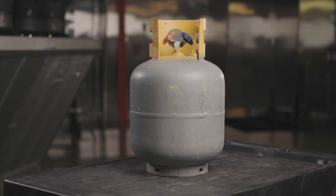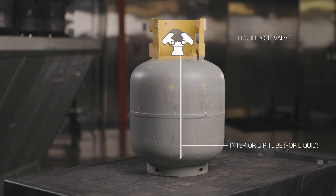If using a recovery cylinder with clean recovered refrigerant to recharge the unit, be sure to connect the common yellow service hose to the valve marked 'liquid' on the tank. There's no need to invert this type of tank, as there is a dip tube in the tank that will pull liquid refrigerant from the bottom of the tank.